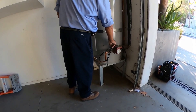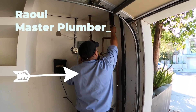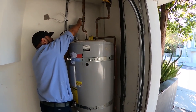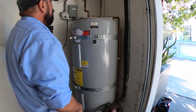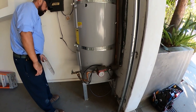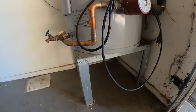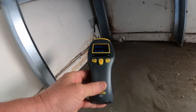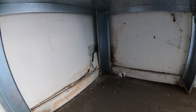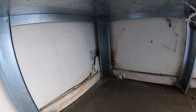You can see here, here's the water heater. Our master plumber Raul is starting to get everything prepped to drain. Look right here — you can see there's been no signs of any leaks on top. When I look at mold conditions, I look at it way beyond just the removal. Here's the mold that the home inspector found during the inspection. So there's definitely some staining there. When I first got to the job to evaluate, I used a moisture device and got a little bit of moisture in this corner here. That's telling me there is an active but very slow leak. So where is it coming from? That's the biggest question.